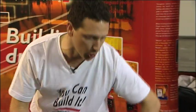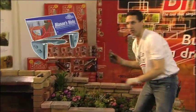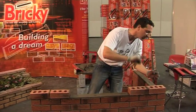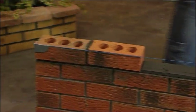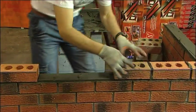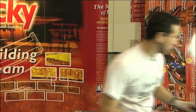Now we need to come to the far end of our wall, set up the end as well, to pull our string line so we get perfect straight lines. I bring you the Mason's Mate — my second invention. Again, pure simplicity: a set of metal brackets. The key being the lip here on the top, which ensures when you set it on the corner of your brick, your line is pinned right off the top corner. Unlike the old line blocks and line pins, it cannot slip. We just bring the top edge of our brick now to meet our string line. There you have it — uniform, clean joints, perfect straight lines.